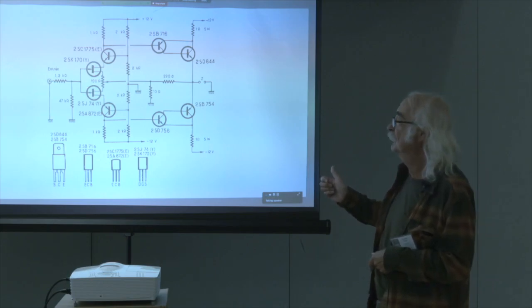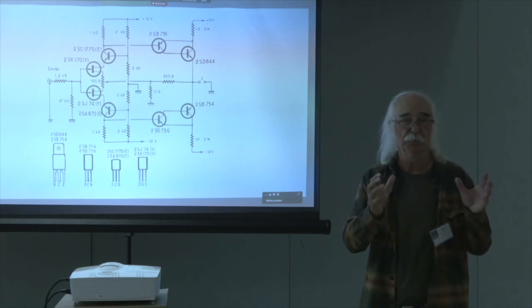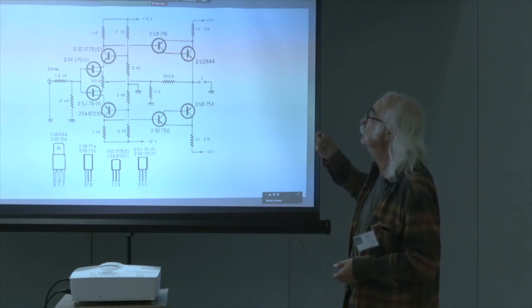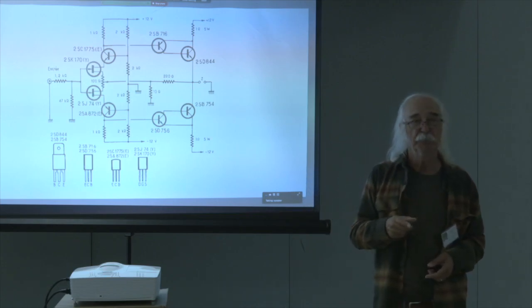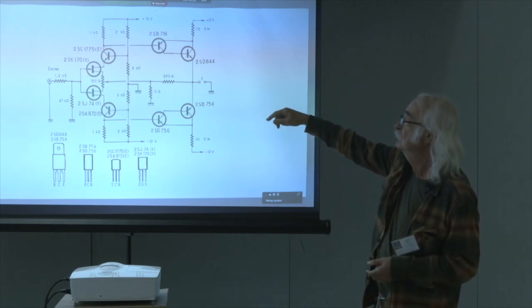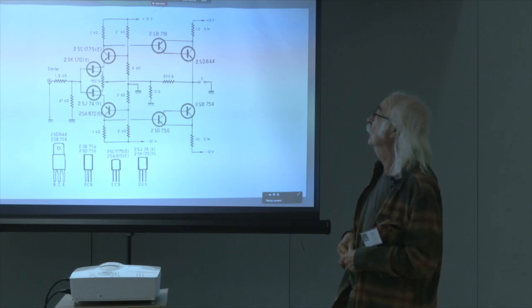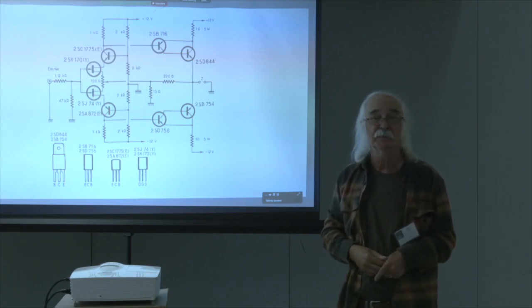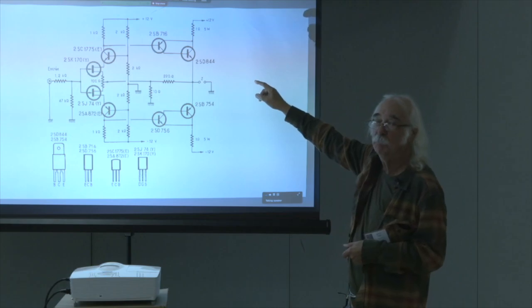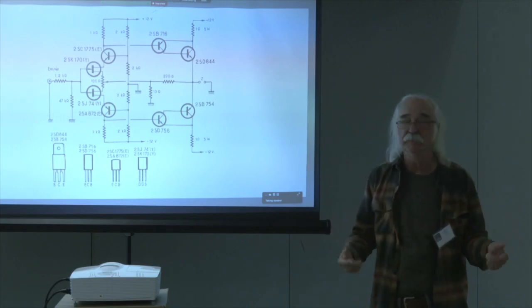And if you look at some of the stuff that we've done in DIY audio, take the concept, for example, of the F5, which is a real simple circuit, input JFETs and a pair of output MOSFETs, in much the same array, but he managed to get this done with bipolars before a lot of the MOSFETs were available that were worth anything. Input JFETs, or the input system, he cascoded them. How nice. That lowers the distortion. And in my case, I usually find that they're unnecessary. It's an actual part that you can get rid of. But he liked it. And then what is the equivalent of a P-channel MOSFET up there and an N-channel MOSFET down there? If you were to make those changes, you'd have an F5.